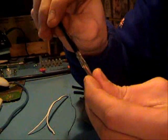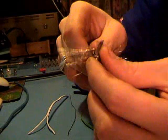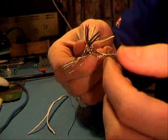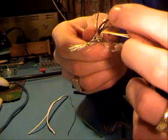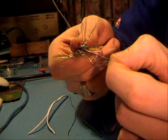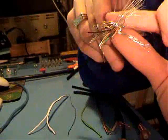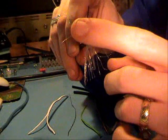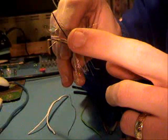Multi-core cable — this one's actually got a shield, unlike the Cat5 which doesn't have a shield around it. You can just peel that back and it's actually got an inner plastic sheet as well. It's eleven core cable — and one of them's not actually a cable, it's just a piece of rubber to help stop you pulling the cable too far or just give it a bit of stability. Good for switches with a lot of inputs or outputs, connecting various things over a long distance using just one cable, extending your microphone cable, or a data cable for your radio.